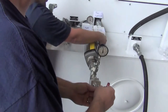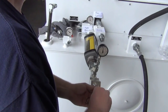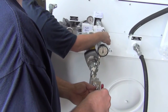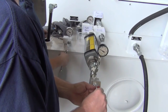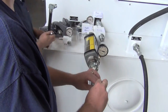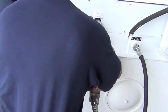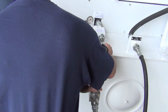We'd be happy to try to walk you through it over the phone — see what you're aiming for, what you're trying to accomplish — give you some things to look for, and if necessary provide any technical support needed to make that happen. But as discussed earlier, if it's just speeding up the tool pressure side of your circuit, adjusting that needle valve that the technician has his hands on right there should be the only adjustment you'd need to make. We strongly discourage you from making adjustments to the FR side of your DFR compensator. It's a tricky process — one thing leads to another, and before you know it you could have lost your way and be in a pickle.